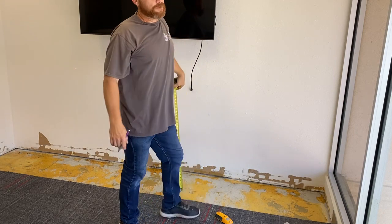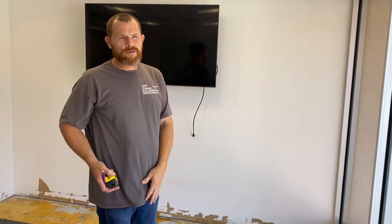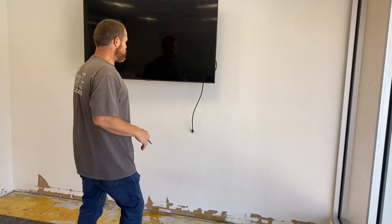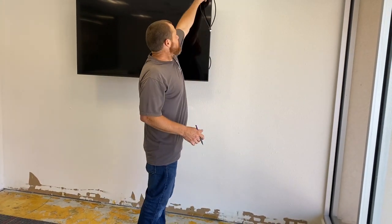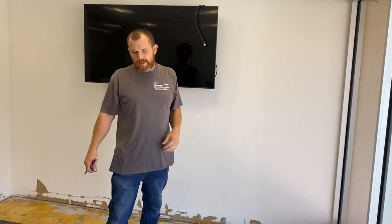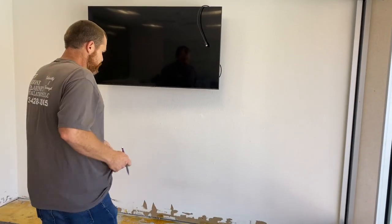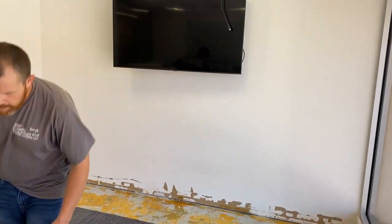Most of your cabinets in today's industry are 34.5 tall. A lot of vanities anymore are 34.5 now. It's all based off a 1.5-inch countertop that nobody gets anymore, to finish the top of your countertop out at 36 inches. Now everybody still makes them 34.5, including us. Most of your tops going on now are only 1.25. But if you ever were to put a laminate top on these, then it does dress back out at 36 inches. Level line across here.